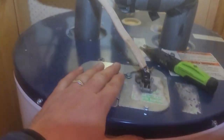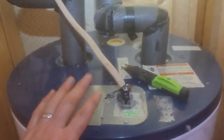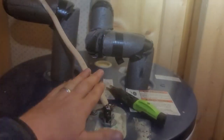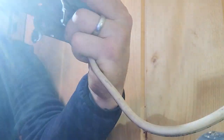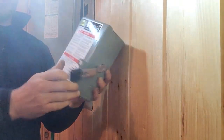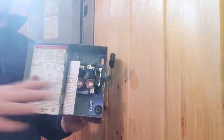Now we're going to install a water heater disconnect. Normally with it being so close to the panel, I would just sleeve this and call it done and put a lockout kit on the panel. But where this wire is pulled so tight and there is zero slack coming out of it, we're going to sleeve it over here and come in the side of a disconnect, then do a proper whip down and up into the water heater. Normally I would have opted for the fuseless throw knife disconnect or even just a fuseless pullout, but with the way the market and the economy is, you just have to take what you can get. So this one is going to have a plug-type Edison style fuse built inside, which is another level of protection for this water heater.